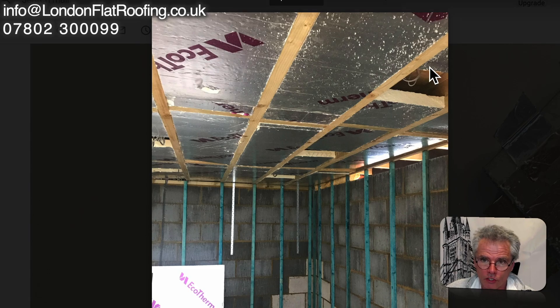If he were back at the earlier stage, the insulation should have been put in and everything foamed so it is absolutely airtight. The top of this wall should have been insulated down to the wall so air could move behind. The air on this roof would be moving back and forth with the vents at each end. At that stage, a vapor barrier should have been put over the top, correctly to standard — every joint taped and made airtight, the vapor barrier taken down the wall and taped with strong, durable tapes.